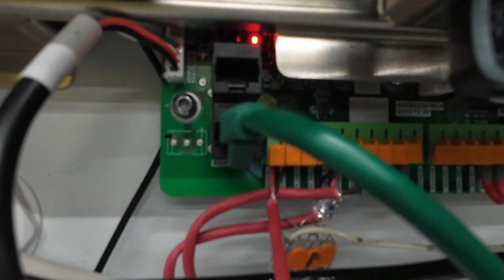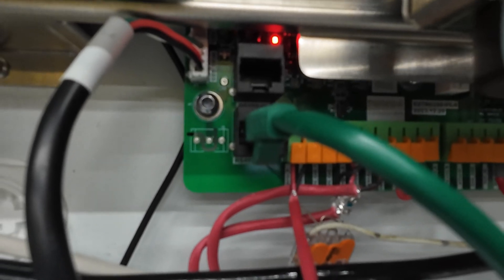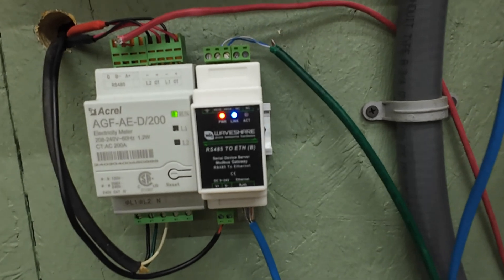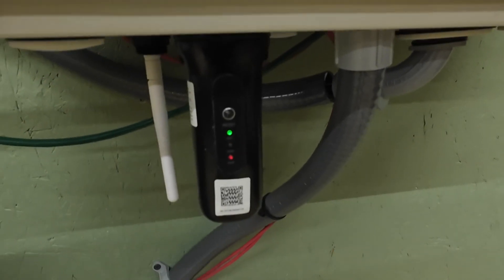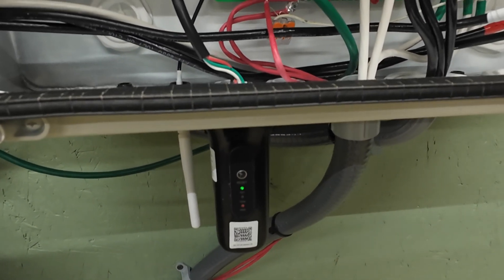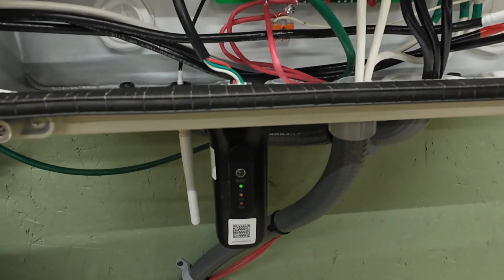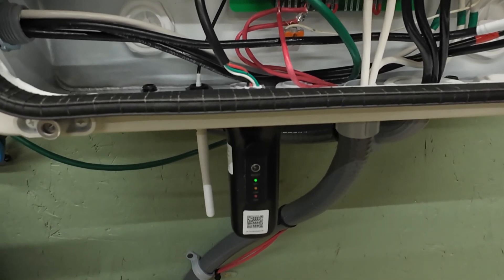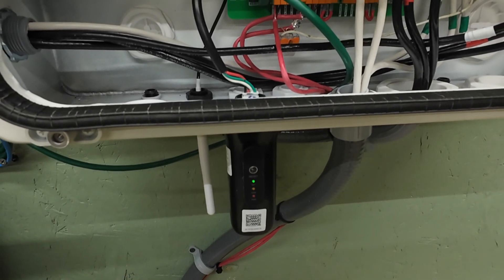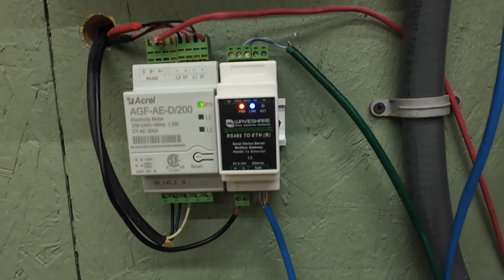There's an RS-485 in and out and it didn't seem to matter which one I plugged into — they both provided data without any issues. The only thing I found with the Waveshare hooked up and the dongle hooked up is there must be some collisions once in a while, because sometimes what's being sent to the Solus web app gets delayed. Normally it's a five-minute rotation and sometimes I'm seeing eight to ten minutes, but at this point I'm not going to worry about it.